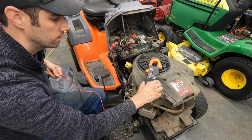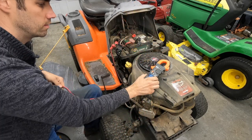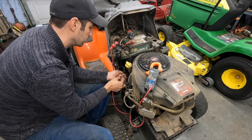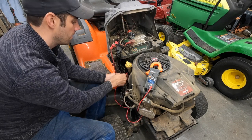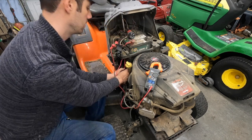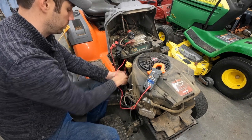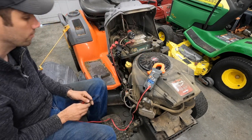We're set to DC volts, and we've got PTO on, key switch turned on, going black into the black terminal. One thing to note: don't cram your multimeter leads into the terminals. If you can back probe it, that's even safer — that way it doesn't splay open the little contacts and cause a bad connection down the road. As you can see, we don't have any voltage. Just to be sure we don't have a ground problem, let's take our black wire and run it up to battery negative. We have zero again. So we are not getting any power down to the electric clutch.